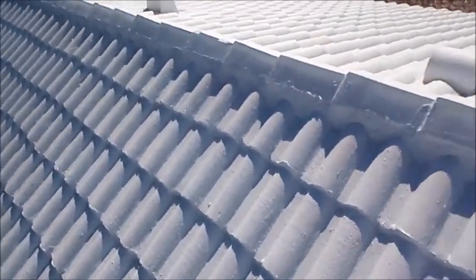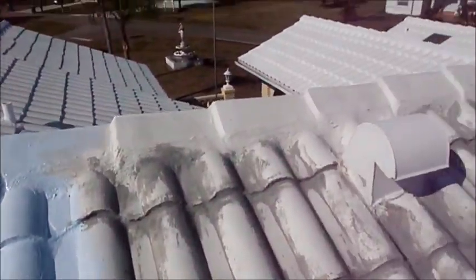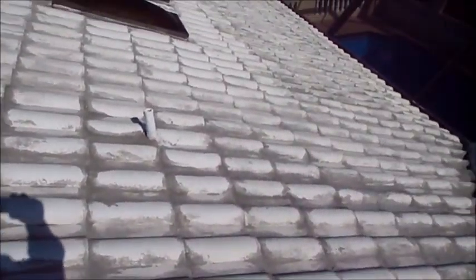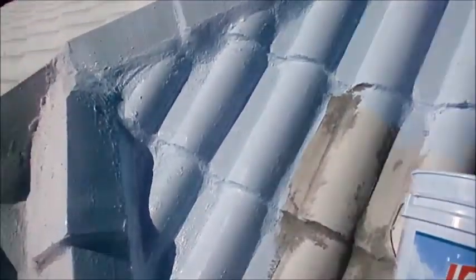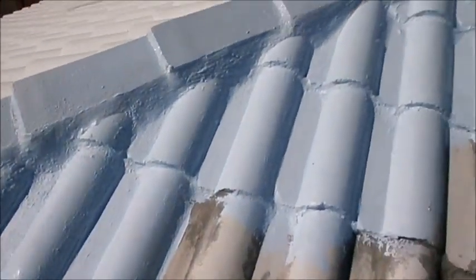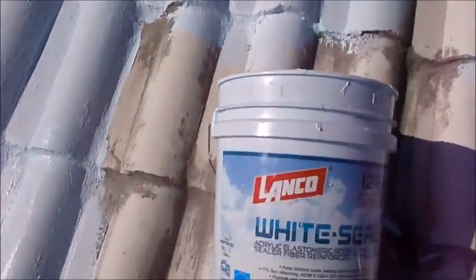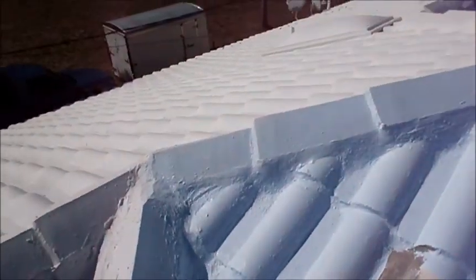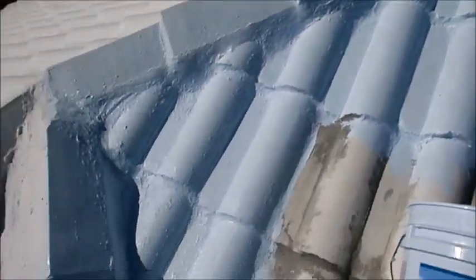I like using a brush — that's how I did the whole roof and it works amazing. It seals everything; the inside feels so cool, you don't have to put your AC on, and this is Florida where we get to 80-90 degrees. I pressure washed the roof, fixed any little cracks with cement here and there, and applied the sealer. It goes on light blue and dries bright white and reflects the heat amazingly. I've used this Lanco sealer on a shingle roof before — it does the same thing.